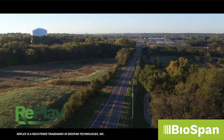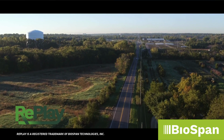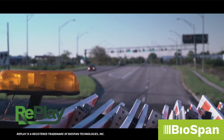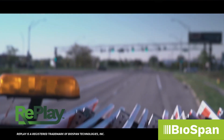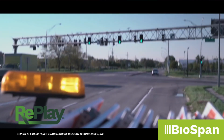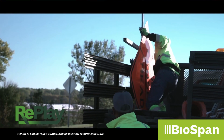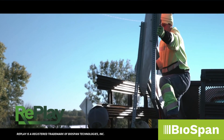Yeah, it's pretty exciting. But let's talk practicalities. If I'm a city planner or a facilities manager, what do I need to consider when deciding whether or not to use RePlay? The white paper actually offers some guidance on that. They mention several factors: the age and condition of the pavement, the climate, the traffic conditions, and of course the budget. They also emphasize working with experienced applicators. Right, to make sure it's applied correctly. Exactly. So it's not just about the product itself, it's also about the application process.